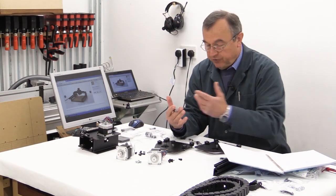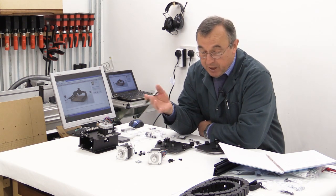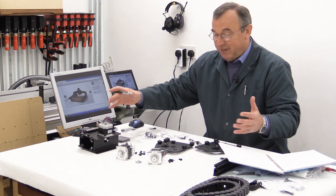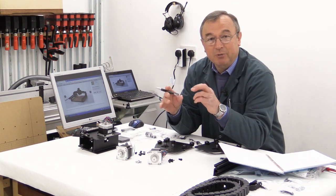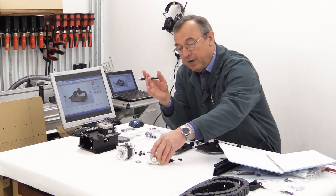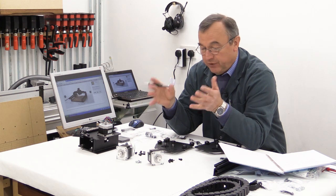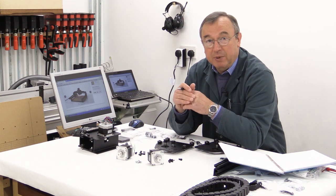The other aspect of having built the machine yourself is that should you want to upgrade it — maybe you started with a small machine and want to make it into the larger machine — so many of the components are common. There's only a relatively small number of items you need to buy to do a major upgrade like that. You might want to upgrade your stepper motors or whatever else it might be — you can do that yourself. And because of the Inventables modular approach, it's going to be relatively inexpensive to upgrade.